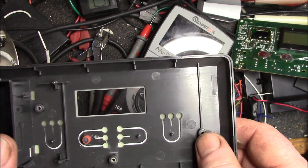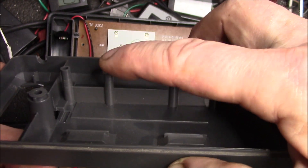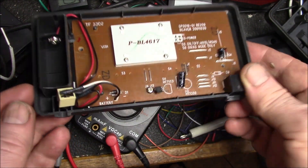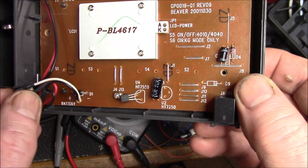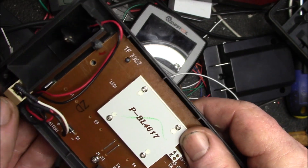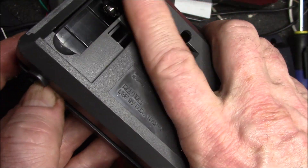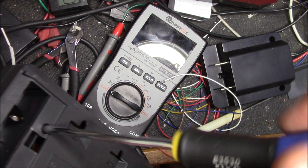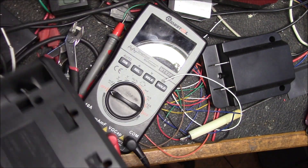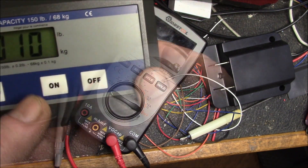One other thing I want to try: I put a little bit of hot melt glue on the end of that stud — this is the stud under the on switch — to hopefully keep a little more pressure on that part of the PC board. Then you've got to get everything tucked in here. The battery cable goes up through here, and the audio jack — that's your power — gets held in by this. There's a longer screw on that side and the shortest screw goes into the PC board.